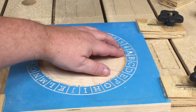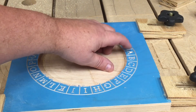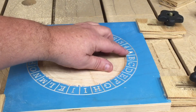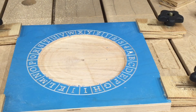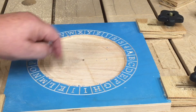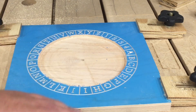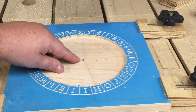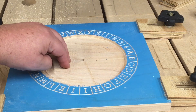The center is all nicely carved out with crisp lines around the edge. You may notice some of the Oramask film came off the A during vacuuming — don't freak out. An easy fix is to stick a new little piece on there, seal it down, cut off any excess, and it'll be like there was never a problem. I've got my center hole in, and everything has happened from this center point without moving the block, so everything is concentric around that point — which is always what I want.